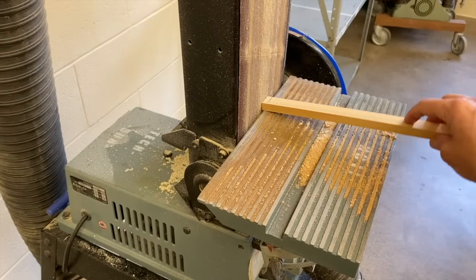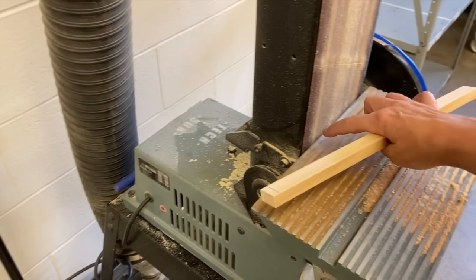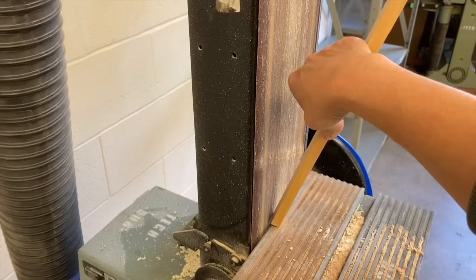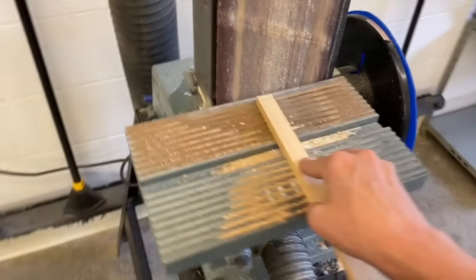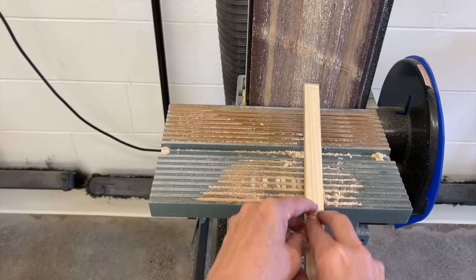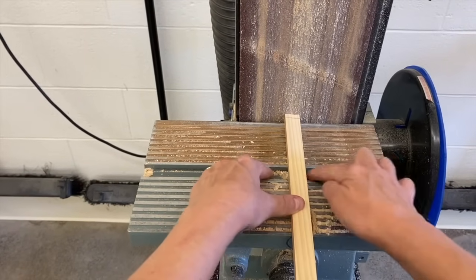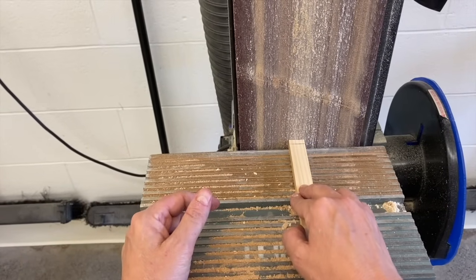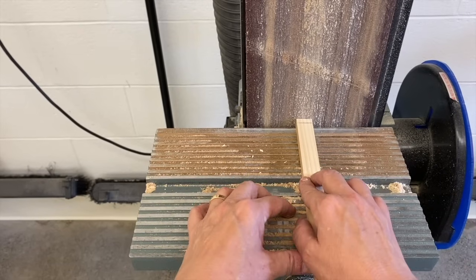This is flat down on the table. If it's not firmly to the table and there's a little space, that's no good — when you go like this, the piece of wood might get caught in there, slam the wood up, and your fingers could go into the belt. So flat down on the table, always flat, never angled. There's also a groove right here that's a great indication of where you should keep your fingers. If you keep them too far back, you'll tilt the wood, which is dangerous. If you get too close past the groove, your fingers are too close to the belt and the belt can hurt you. The belt takes a tremendous amount of wood away in a really fast amount of time, so keep your fingers right at that groove.